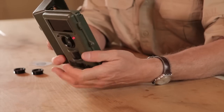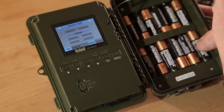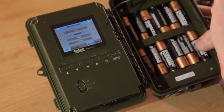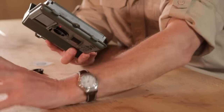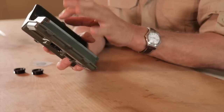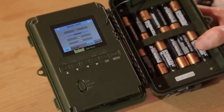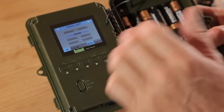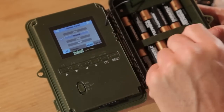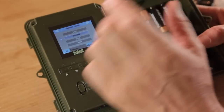Sensor level is about the passive infrared sensor and how it reacts to movement — low, normal, high, or auto. If the camera is in an area with lots of movement like grass waving or leaves blowing and lots of temperature shift, you might set it to low. If it's a flat clear area like a path or lawn, you might set it to high so even a mouse in the background triggers it. Normal is middle of the road, and auto hunts around for whatever movement is going on. I'll leave it at normal.